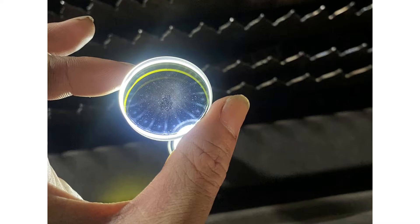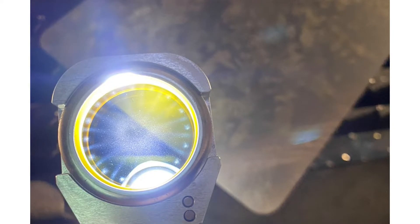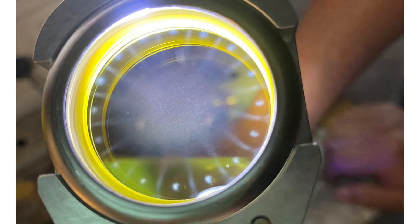The first case: there is some dirt in the middle of the lens and some scattering marks. Such lenses usually occur during air cutting when the compressed air is not very pure. We need to check the dryer of the air compressor — its exhaust time setting and exhaust interval setting.